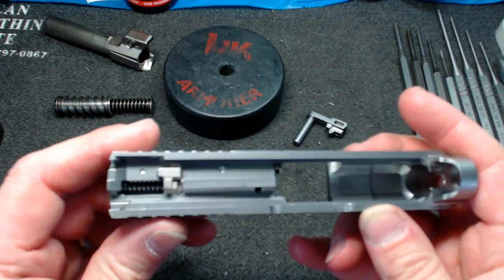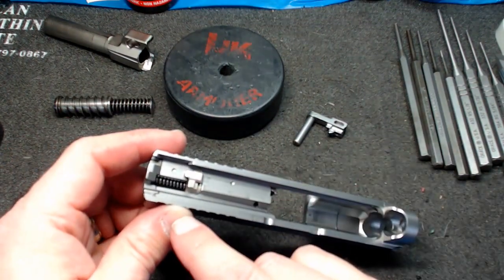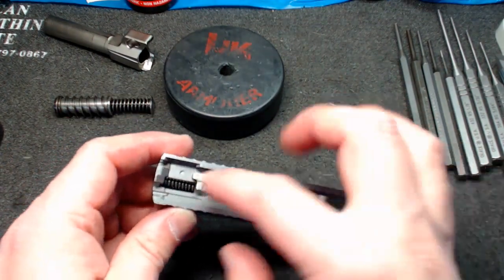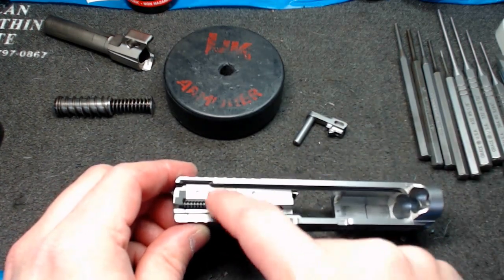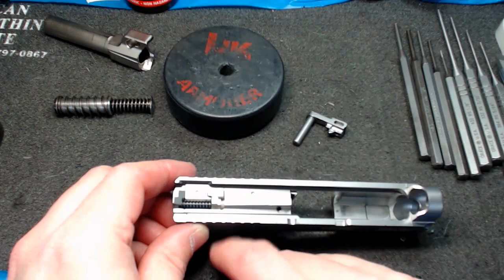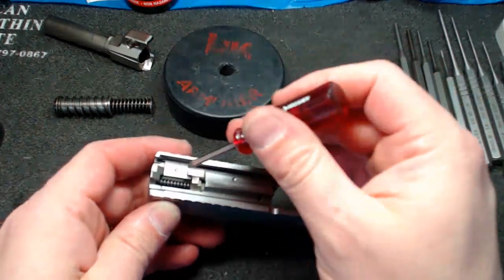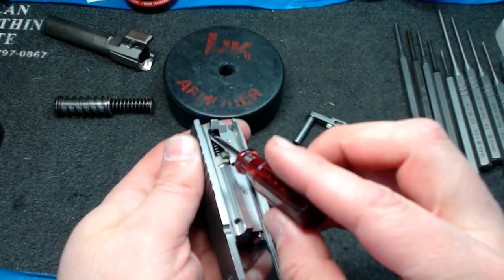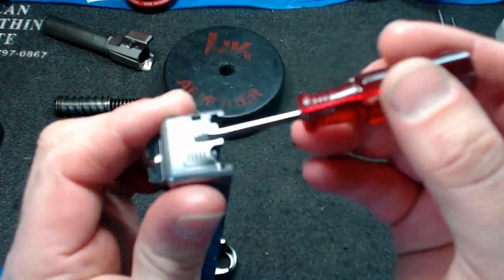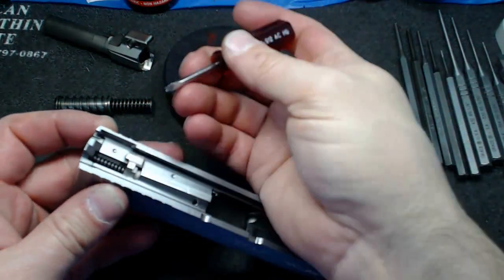If I recall, there's no real good way to get this spring back. So if you look in here, you can see a white sleeve in front of the striker. You see the striker, and then you see a black plastic piece with the firing pin spring around it. Basically, the back, way in there, of the black plastic piece is actually what's in the end cap and kind of in our way for what we need to do to take it down.